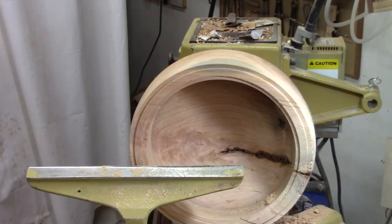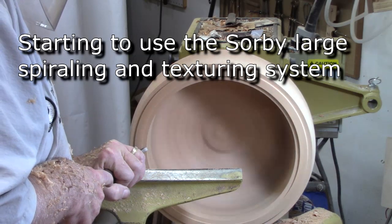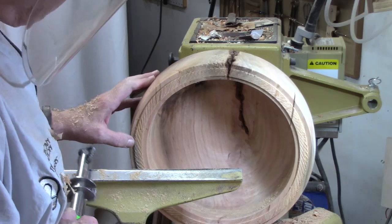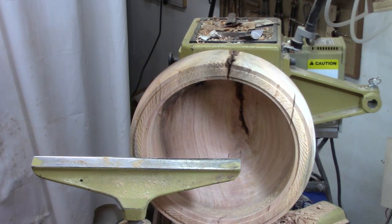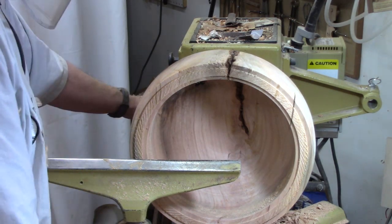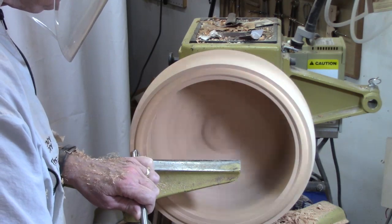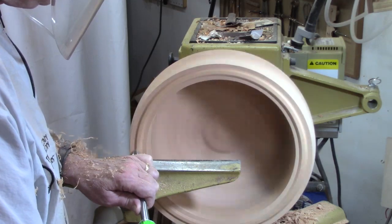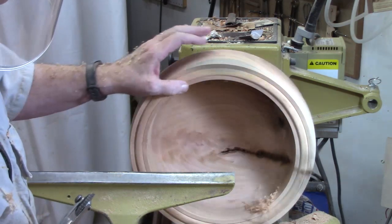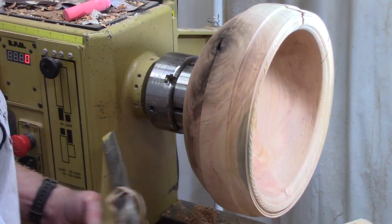After sharpening, I'm going to put a rope texture bead around the top. That's definitely a rope-looking texture. Let's go ahead and round over the bead and come back and do it again — just round over this bead a little bit on both sides so we can come back and finish this rope texture. And there we've got a very nice rough-looking rope. I lowered the area around this big flat bead; now I'm going to sand it and then come back and texture it.